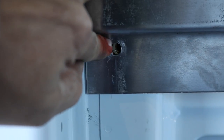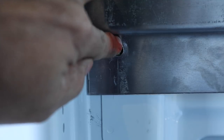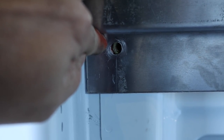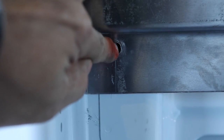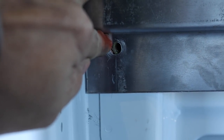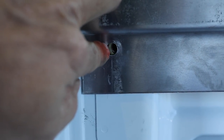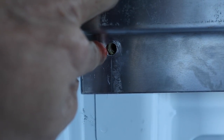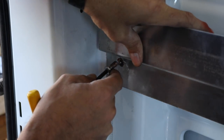Here in the D-pillar we have a little bit of an issue. There were two layers of steel, and when I drilled through, one was hanging over and pushed the drill bit to the right-hand side. It's not a problem - we'll take the die grinder and take a little bit out of there. It's going to be covered with a washer anyway since we'll be powder coating all this, and we'll put a stainless steel washer bigger than the cap head to cover it.